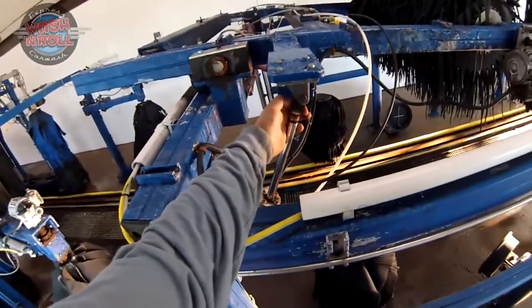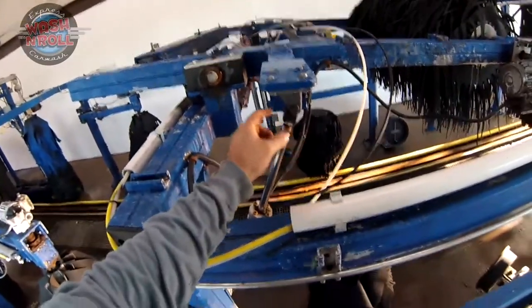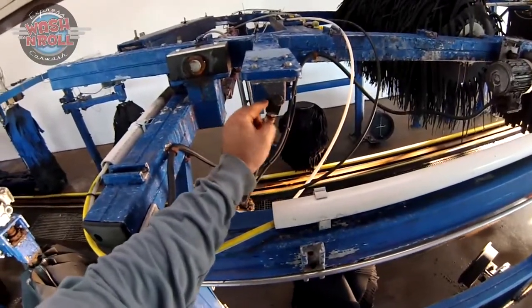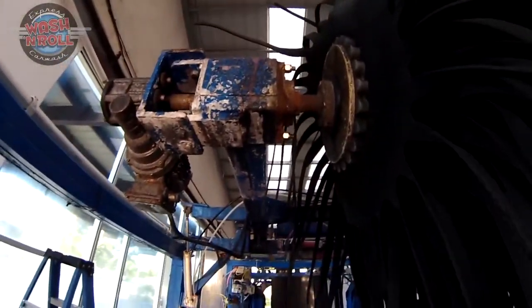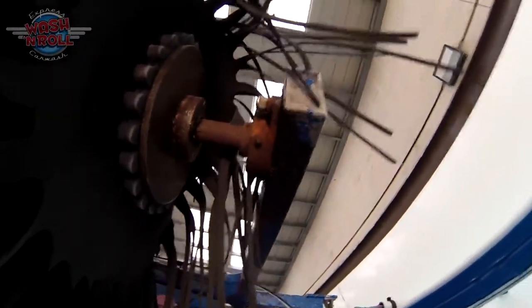At stores four, five, and six your top brush doesn't work on a clevis pin — it works on a bearing. So you'll have another grease zert right here on a small bearing to grease. You also have a bearing on either side of your top brush: one on the inside and one on this side with its grease zert, hopefully on the bottom so they're easier to reach.